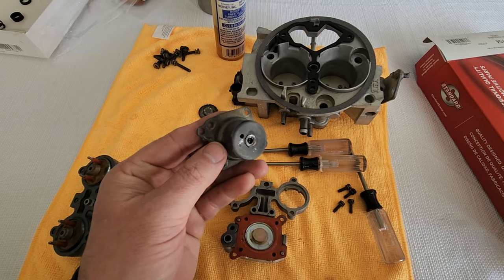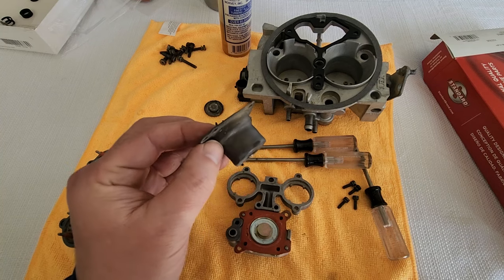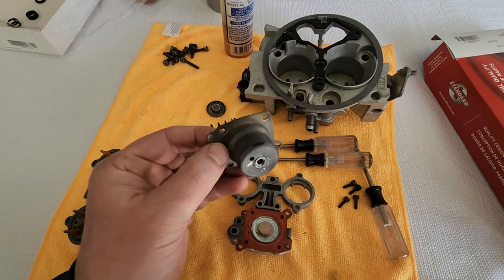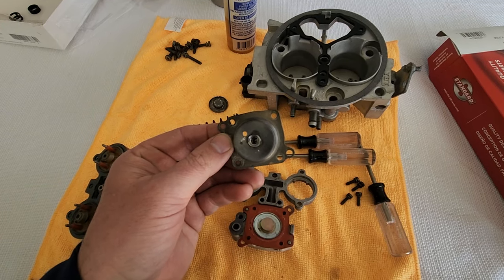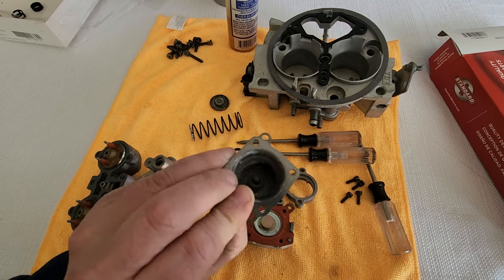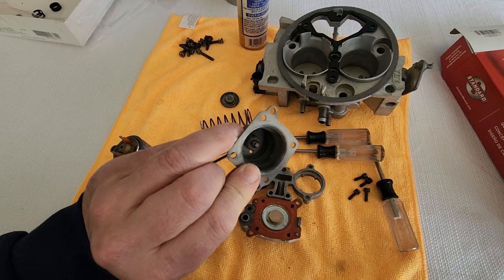So I drilled it out carefully. It's brass — I tried to heat it up first and get it to melt, but I was afraid I was going to deform this housing here. So I drilled it out carefully, and once I drilled it out I found that the set screw was accessible and I was able to screw it in and screw it back out without too much trouble.